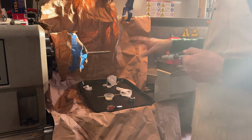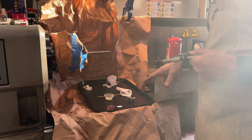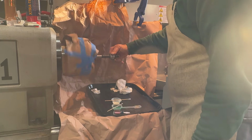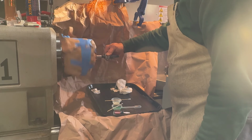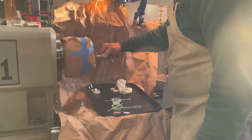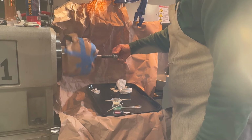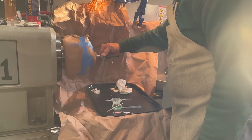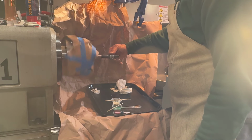I think it's been very slow. This is aluminum oxide in oil. We may try something else. I'm going to give it some thought. So this is Timesaver, Timesaver 77 in DTE 32 light oil, an exact concentration of I have no idea what. I think I could feel a little more bite. I think the aluminum oxide was a little too fine.